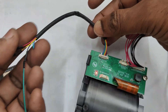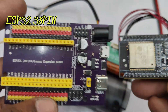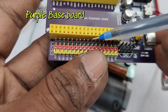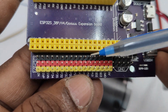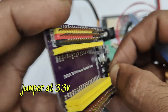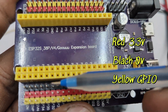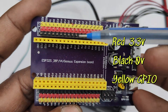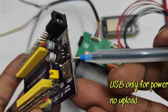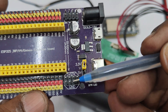We will be using the ESP32 38-pin version. Our communication is TTL — only the RX pin and ground are used. We will be using a baseboard, a purple baseboard with three rows of pins: a red row, black row, and GPIO pins on the yellow row. There is a jumper — place it at the 3.3 volt level since the ESP32 GPIO pins are at 3.3V. All red rail pins will then be at 3.3 volt, black is zero, and GPIO pins are on the yellow pins. There is a DC jack for supply and also USB sockets.